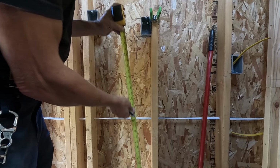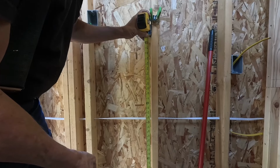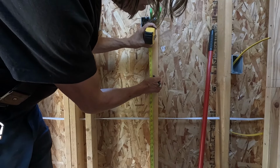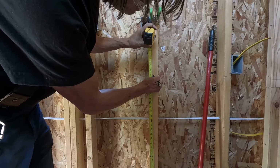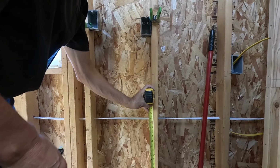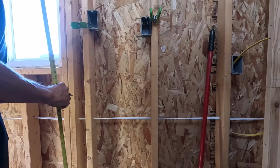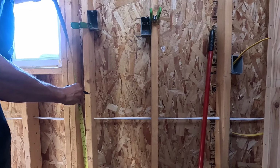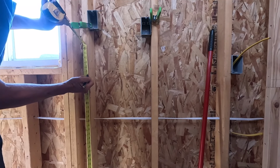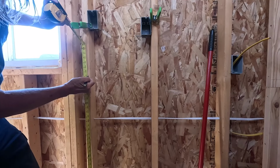All of these boxes are going to be in the middle of the backsplash above the counter, and the bottom needs to be 42 1/8. So we'll get these marked off and nailed into place, and then start drilling some holes. Well, we'll have to mark for the holes as well.